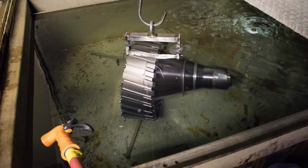Additionally, cleaning parts beforehand will decrease contamination in your bath. This reduces the changeover and maintenance time to keep it at appropriate contamination levels. This is similar to what Richard was discussing earlier with the centrifuge tube. Ultimately, ensuring you have a clean part before testing will reduce your percentage of missed indications and the number of bath changeovers required due to contamination.